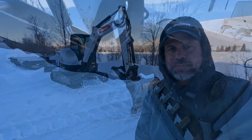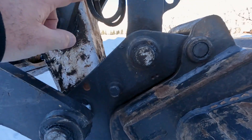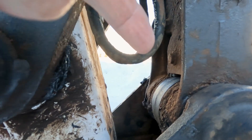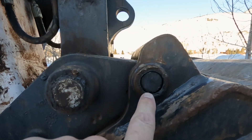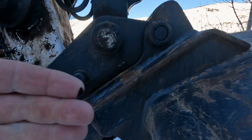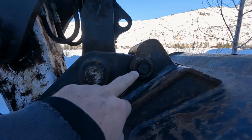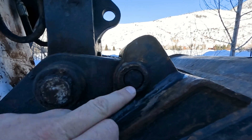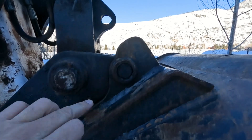Let's take a look at the problem and what makes them leak. On the Bobcat, this hydraulic coupler has lines that come down through this swivel bank. We're no longer using this swivel - we're using a manifold, which is a much better design. We push a button in the cab, retract these pistons, and that's how we take our bucket on and off without leaving the cab. These pins hold through the end of the bucket and take a lot of stress when digging.